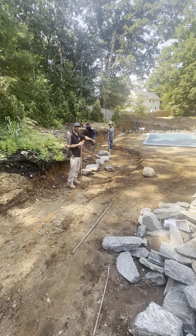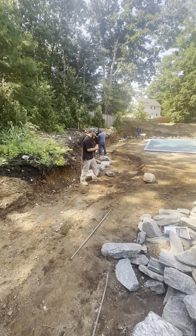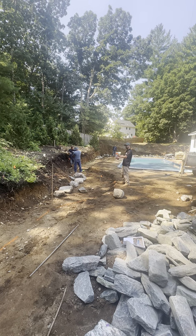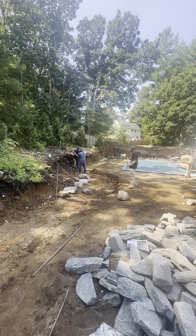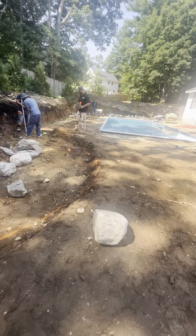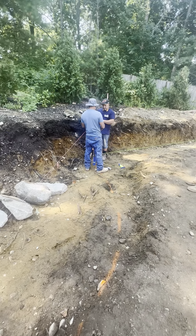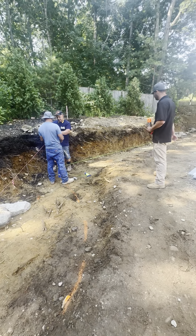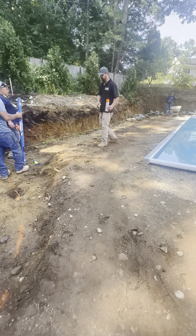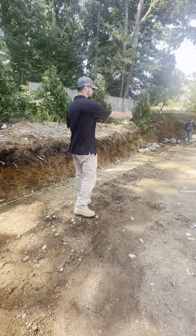Good, so this is the square — the shed, right. What we did here is we put a PVC pipe in a nice round circle. When we make it a little bigger, the plan shows it over here on the design as a square from the pool. If you build the wall like this, when you do the pad it's gonna look funny. He has seven feet four here, but over there is much more space. So what we did is put nine feet here and nine feet there — now this is square with the pool.